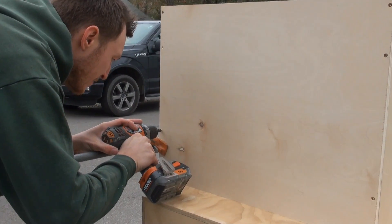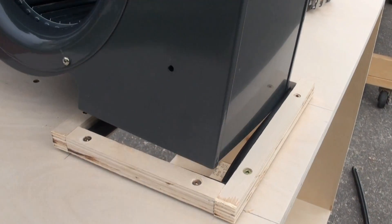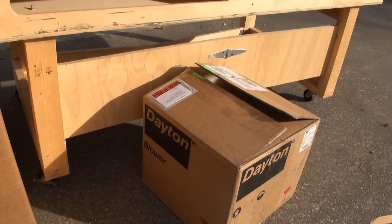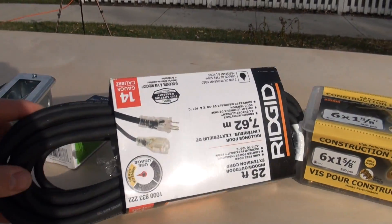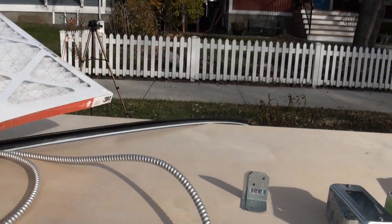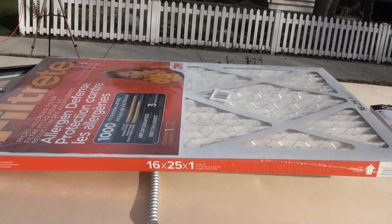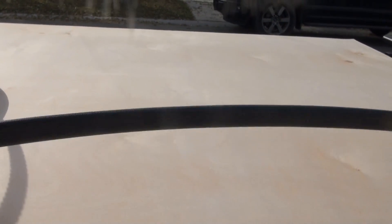The basic process is pretty simple: we're going to cut all of our plywood for all sides of the box, screw it all together, then put a hole in the top where the outlet of the fan can go, and figure out a way to mount the fan on top and wire everything up. Here are some of the materials we're using today: the filter and the blower fan, wood screws, an electrical cord that we'll cut the end off to wire up the fan, a switch with cable, a pre-filter that sits on top of the blower fan to prevent the HEPA filter from clogging, and some weather stripping to seal the inlet of the fan into the top of the hood.